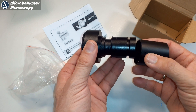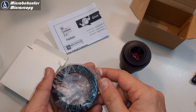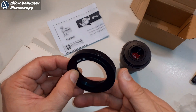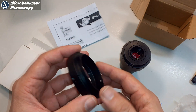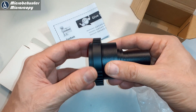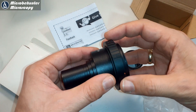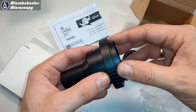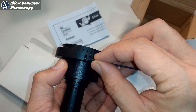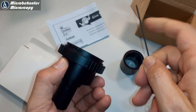This is the adapter. There is also an optics element in there, and then two more smaller adapters. The first one is a C-mount, and the other one allows me to plug it into a stereo microscope because the eyepiece diameter is different. This here is the T2 adapter ring — a standard piece that can also be used in astronomy for connecting a camera to a telescope. It screws on like this, though I realized it was still loose; unfortunately I could not find the small wrench that was included, so I used my own.